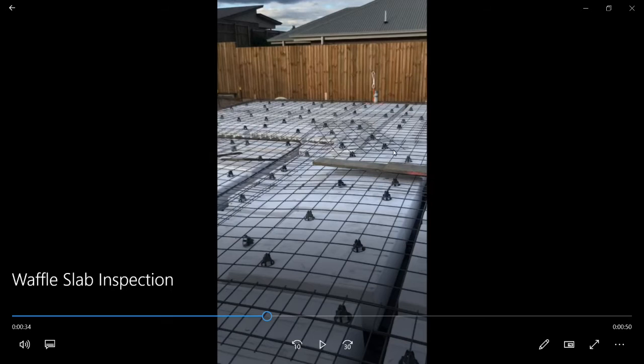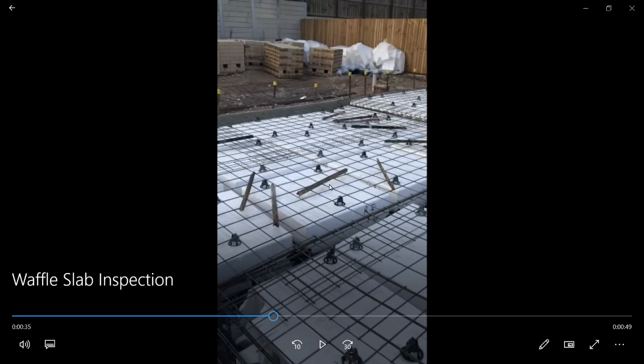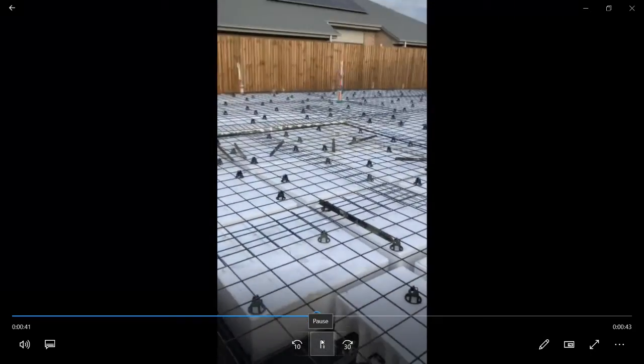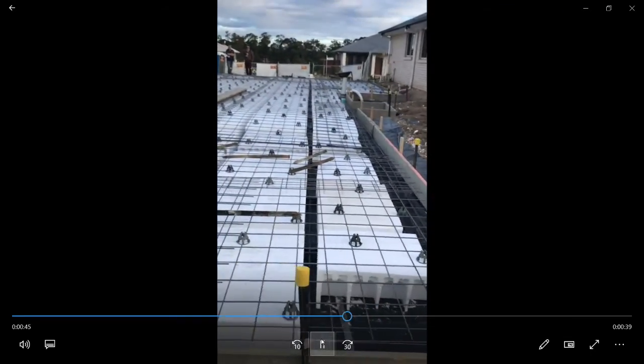Stepping back here — through this area is where the slab goes from inside to outside. This would be the outside area; there's a strong beam through here with the extra reinforcement on top, and then this is probably the patio slab in the back, which is set a little bit lower. This is part of the problem we have with waffle slabs: the waffle pods have to be the same height for strength, but set a little bit lower here, it actually allows water to get in underneath the house and it can't get away — it's in there like a swimming pool.